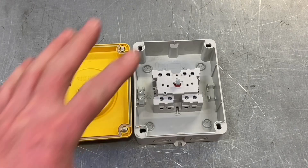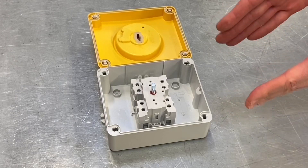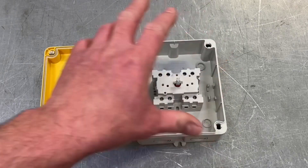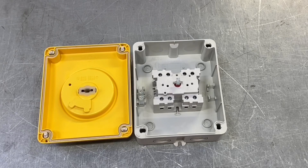Within this range, you can get switching devices from 16 amps all the way up to 160 amps — a massive range of switching currents. It's an AC 22 switch, meaning it's capable of switching mixed resistive and inductive loads. It's also an AC 23 switch, which means it can be used to switch motors and other highly inductive loads.